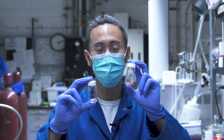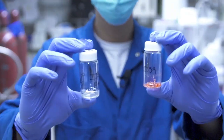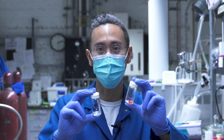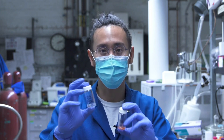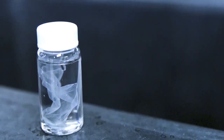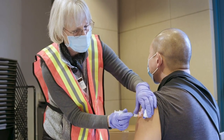This pink polymer I have here is called our random heteropolymer, or RHP for short. It is the special secret ingredient in our truly compostable plastics — we use it to protect the enzymes that are inside our plastics that eat it and make it compostable. To mix it with the enzymes and form that protective layer, we first dissolve it in water overnight, which allows us to then mix it with the enzymes, which are also in water.